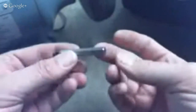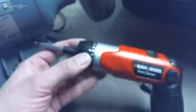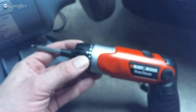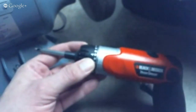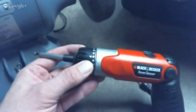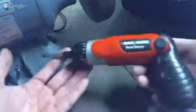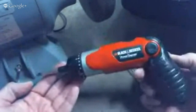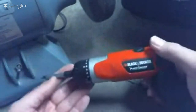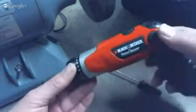There are tools — the reason we make the deburring tool in a hex form with a quarter-inch hex on the end is so that you can use it in a cordless screwdriver. The tool is very lightweight. You can get lithium-ion ones now that are smaller and lighter. The smallest, lightest one you can find is what you really want to use, because you don't want to put much pressure — just like when you're drilling the material.